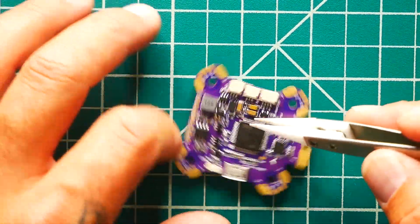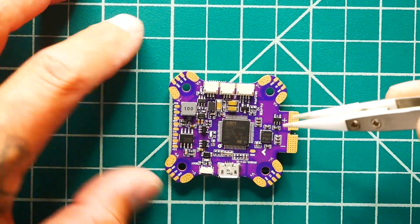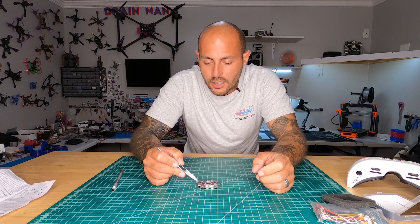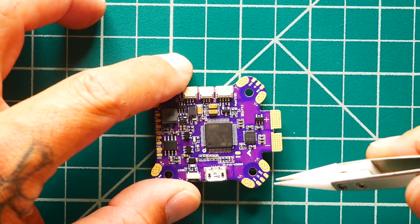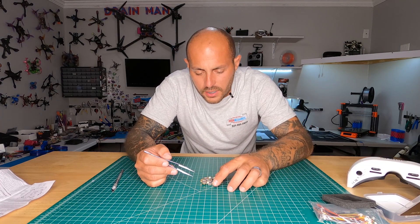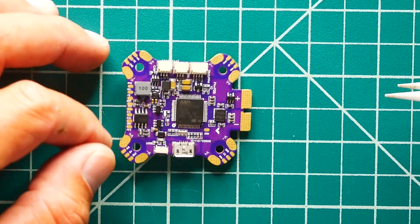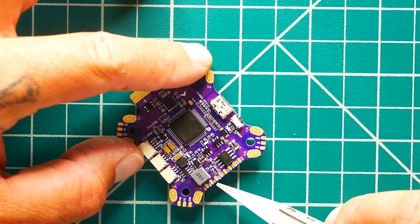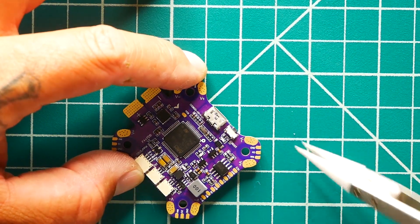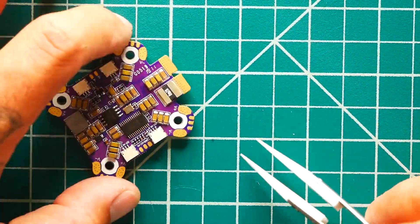Jumping right in, we've got an F405 RGT6 MCU — that's the standard F405 microcontroller used in flight controllers. We've got a boot button and LED indicator, the MPU-6000 looking absolutely gorgeous, a couple of LDOs, onboard flash, Betaflight OSD, and a crystal and resonator. Over here we have a full UART, 5V, ground, another UART, another ground, and 3.3V. I'm not immediately seeing dedicated pads laid out for receiver, VTX, or video connections.